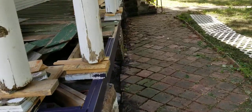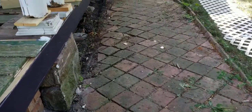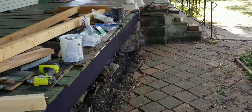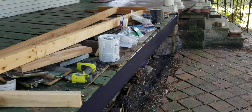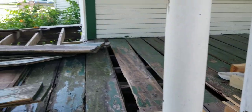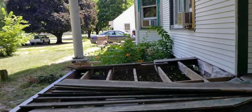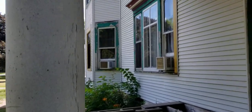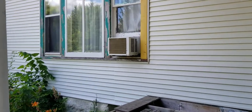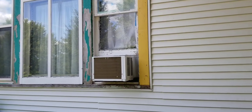Short video, but it's well worth it to prep like this. The paint job is going to last a lot longer without any degradation. If you just do one coat, you're going to be having to repaint every five years — it doesn't matter what paint you use, especially on the side of the house which gets the most beating. This side of the house gets the crap beat out of it. You can tell just by the woodwork — it beat off all the paint. When they painted this, they didn't do the primer and then the paint. I think they even used interior paint. The painter did, and it's just a horrible job.